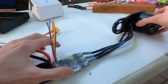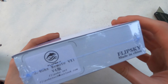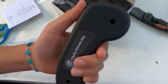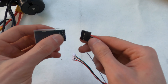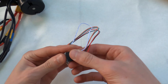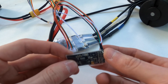That's a quick summary of how the electronics are wired. At this point the only thing left to do is plug in the receiver, which you'll end up doing later after you've programmed the VESC and built everything. The remote we are using is the FlipSky VX1, which is a great option because it's on the cheaper end of DIY electric skateboard remotes but has a ton of really cool features and is really easy to use. For the receiver wire, make sure you have the version 4 wires because the TorqueBoards ESC is a version 4 VESC. Ensure the red wire is on the far right pin of the receiver, and then you'll be able to plug the JST connector onto the UART port on the TorqueESC.